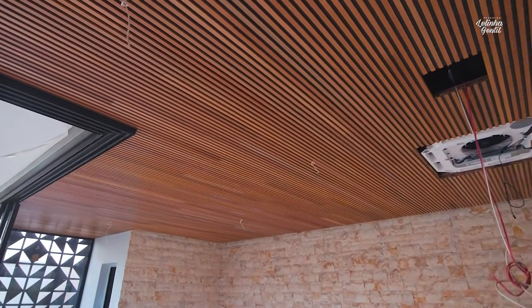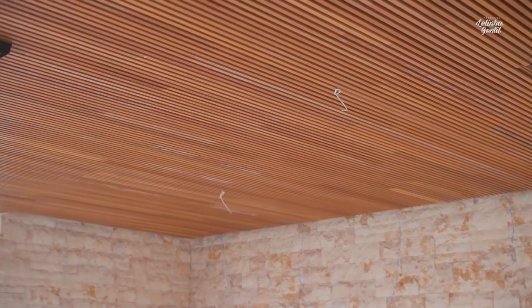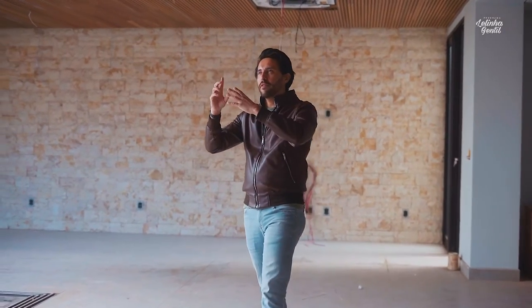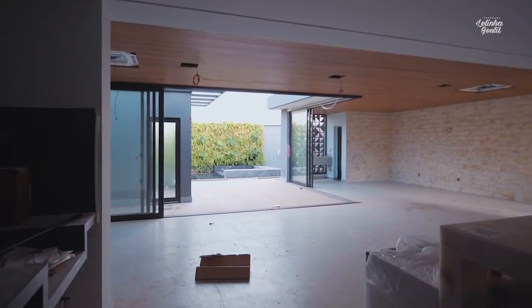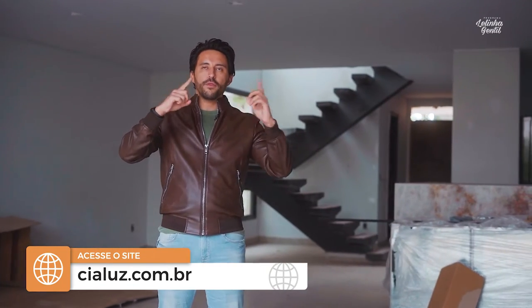However, while organizing this, we made a slatted ceiling of natural wood, and we took advantage of those slats to place lighting profiles between them. Further ahead we'll be able to show those installed profiles better, because the idea was to place several profiles in asymmetric positions — this creates an interplay within the slat pattern itself, serving both a lighting and a decorative function due to their positioning in the ceiling.